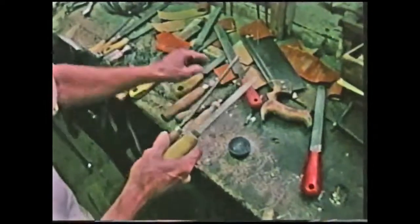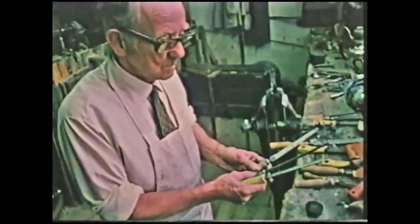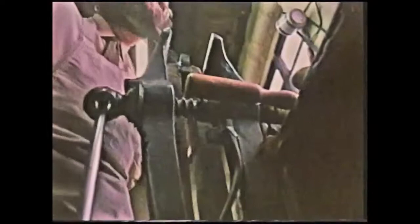The most used tool is the floit, spelled float, but always pronounced in the traditional South Yorkshire way, which is a single cut file which is made by the craftsman, each one lasting about a year. Here, from left to right, are a half-round floit, a strong floit, and an average one. The vise used, incidentally, is one of a particular pattern which is seldom seen nowadays, and is called a leg vise, having long legs which reach down to the floor and provide maximum steadiness against the movement of the floit.